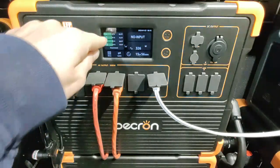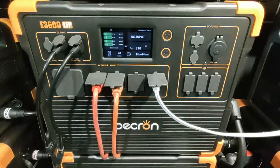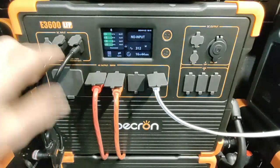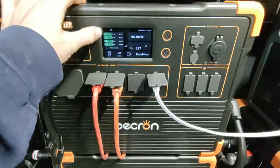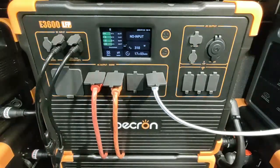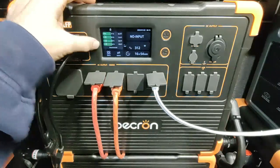Notice that the battery cells are at 41, 43, 46, and 44 percent. One of them is not really far off - that last battery when you have it hooked up is the strange thing. My question for Pekron: why is it when I run a 12,000 watt-hour system - only three batteries and the host - does the power meter stay within about 5% across all batteries? But when I put on that fourth extra battery on the bottom, the power meter gets funny. It seems like a programming thing.